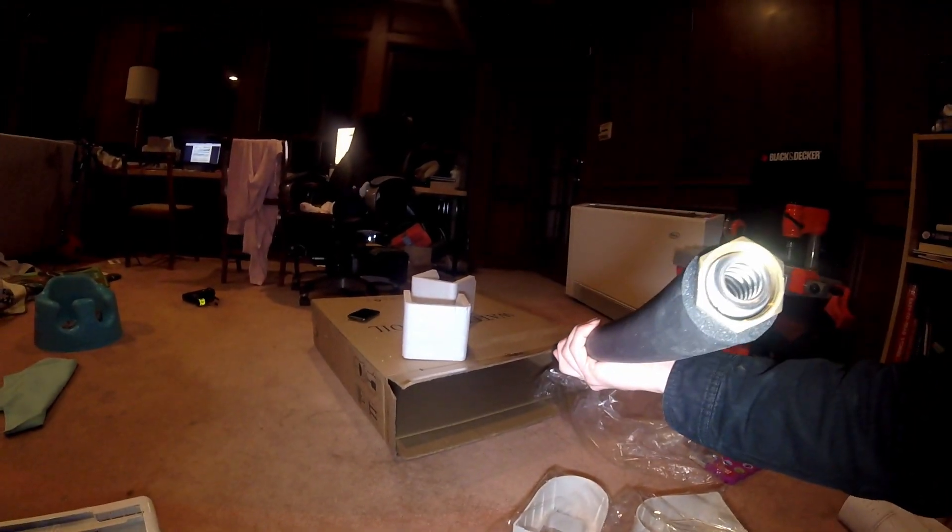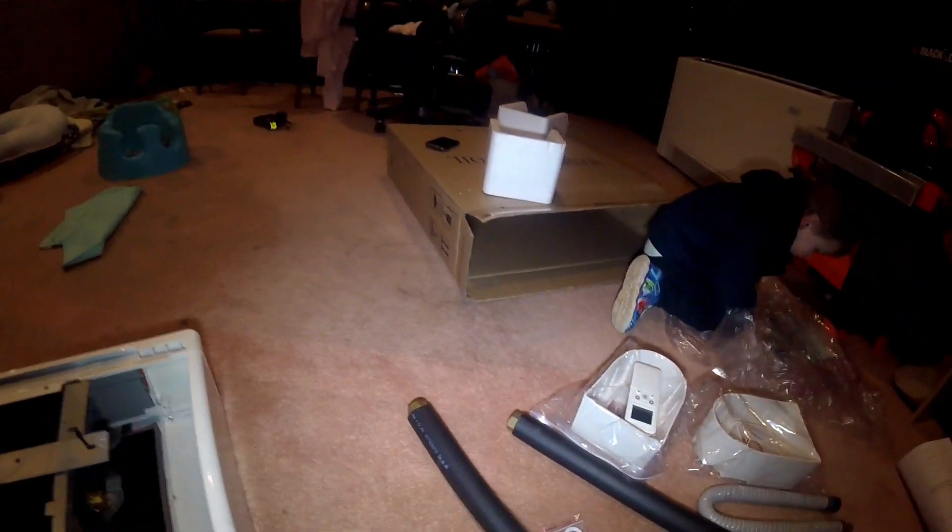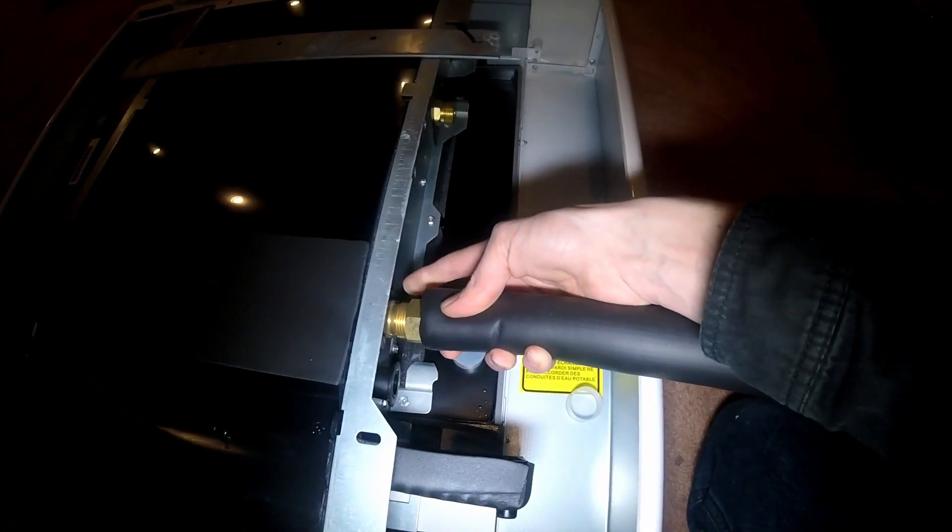What you've got here is your water in and your water out. You'll notice on your tubes here, this end has a more square nut on it, this end is more rounded. That's because one of these is an NPT fitting and one of them is a garden hose fitting — and they actually say that on the side, I didn't catch this at first. On the garden hose fitting, the threads are not the seal; it's going to seal up against this piece of metal right here on the inside. So from this hardware bag you've got these white washers — you'll pop that white washer down onto there. Even though this is an NPT thread, it'll seal against the surface there, with the square ends up against the water coil unit.